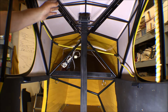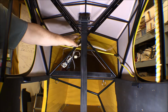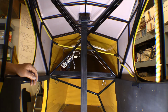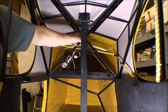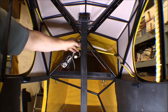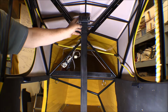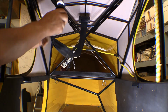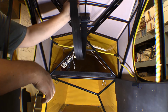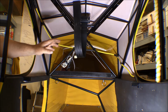I got these flap cables put in. The left one runs down this side, and they tie in back here to the main cable. And those put in with an AN3-5 bolt with an AN310 castellated nut and a cotter pin. So those are all in. Cotter pins are in, so they're safetied in. Everything's all copacetic on those. Put the shoulder harness back in. That's all tied up in there. I could put the headliner in now. That's what I needed to do to put that in.